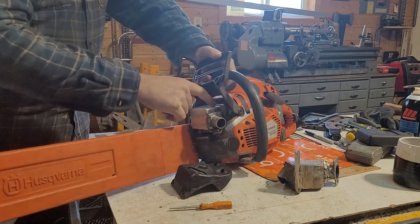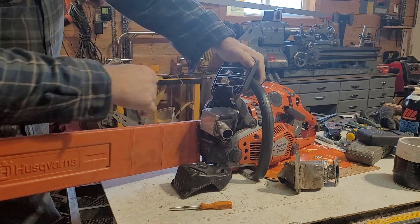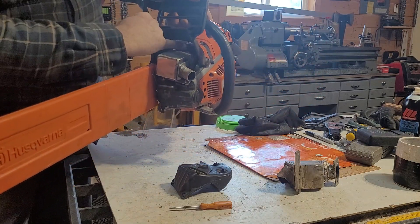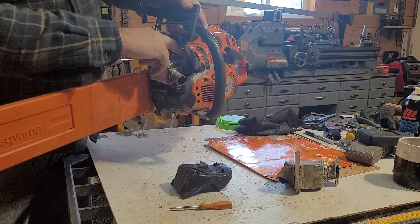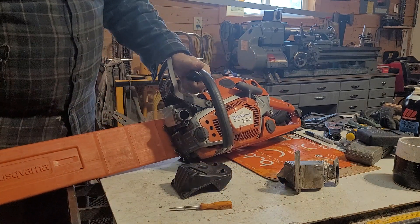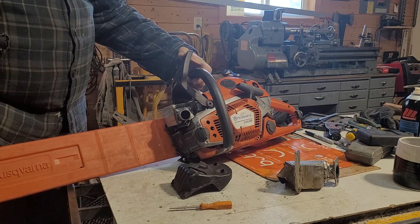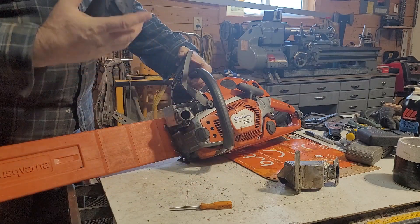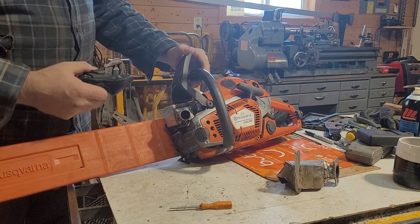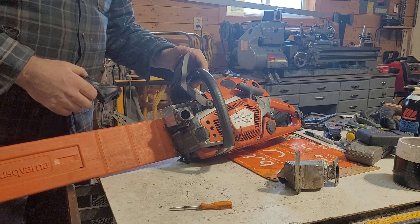Pretty much straight out. This one does have an aluminum baffle plate in it with a bunch of holes drilled. A lot of people know that aluminum dissipates heat between seven and ten times better than steel does. It's also way lighter. So for both those reasons, I feel it's a worthwhile investment doing aluminum exhaust systems on these saws.